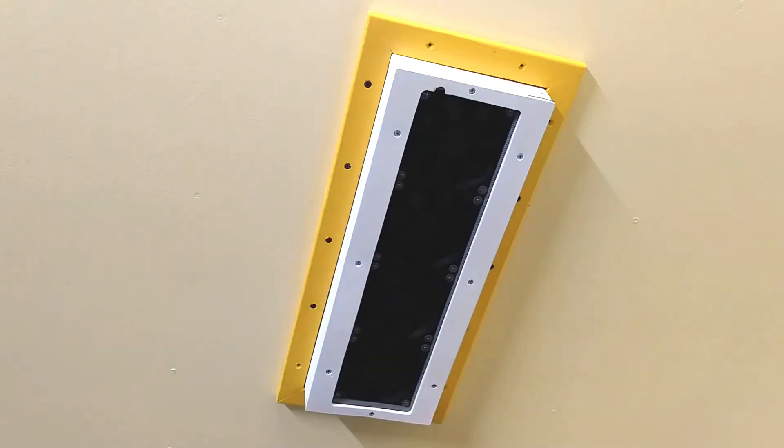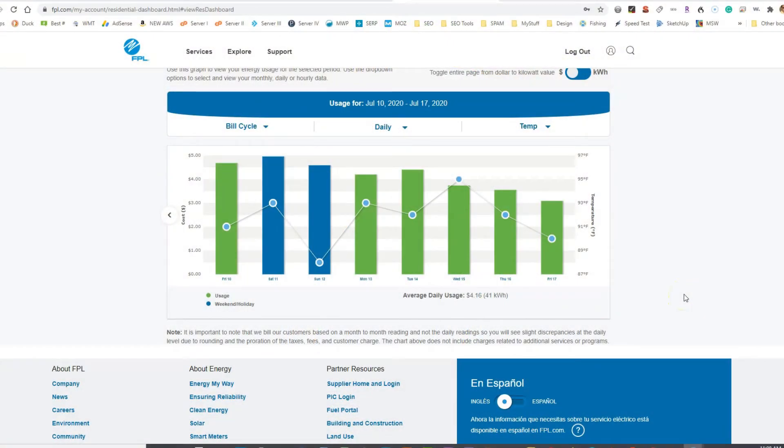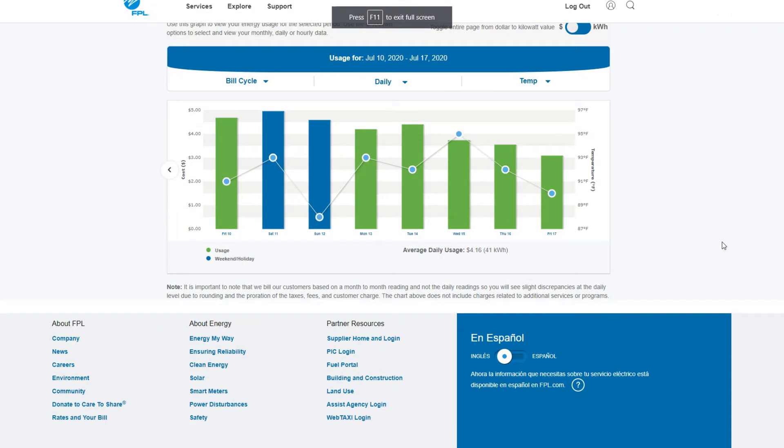If I had to do anything over, I would step up the size of the fans. Right now I'm at about 370 CFM, but I think about 1,000 CFM would give much, much better performance. As far as electricity consumption, it's doing what everyone claims — the AC is becoming a lot more efficient. I can actually hear it cycling on less frequently during the hour. I've only had it on for a few days, but my electricity consumption has actually gone down, even though temperatures are still holding in the mid-90s. The next step is to get our evaporative cooling system up and running, and I really hope we can improve on these numbers.